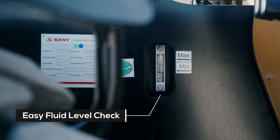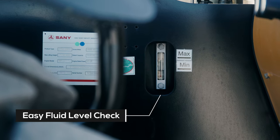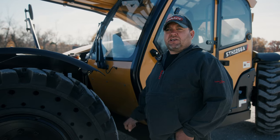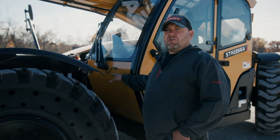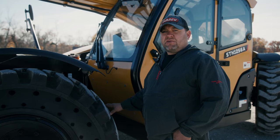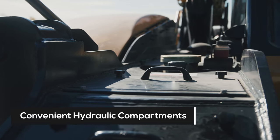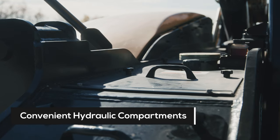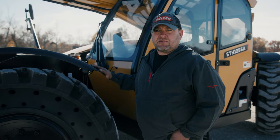There's a visible hydraulic fluid tank level that the operator can check daily without having to open any panels. On most competitors, you've got to access it through a panel, open the door, check it — and a lot of guys aren't going to do that every day. With this one, you walk by, you look at it, you get in the cab and go. In addition to your visible sight glass, on top you have two removable panels that contain all your hydraulic components. They're very easy to inspect, very easy to work on — and a lot of manufacturers don't offer that.